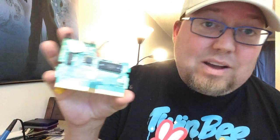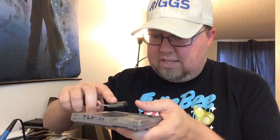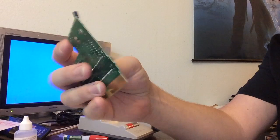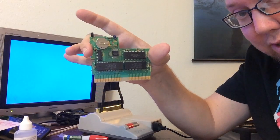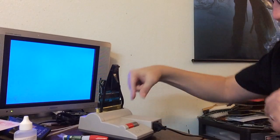Now the thing is, The Immortal is a TL-ROM, and I don't happen to have a spare TL-ROM laying around. I do have a spare TK-ROM. The TK-ROM is like a TL-ROM or a TS-ROM with a battery. The battery won't matter for this game, but the game should still play even though it doesn't need the extra stuff — it will still work if I can just pop it right in. This is the PRG, which will go right in the PRG area. I'm going to solder these in place and see what happens. So here it is — a TL-ROM on a TK-ROM board, all soldered in place. No extra wires needed since it's a straight trade-through. I'm basing this on the fact that I've made TL-ROM repros using TK-ROM boards before, so this should work. I'm going to use it through a Game Genie, just because it's easier to pull the pins in and out and push it into the system.